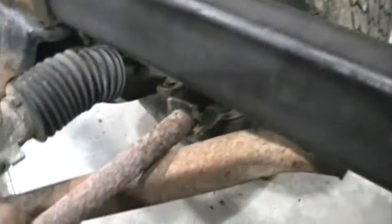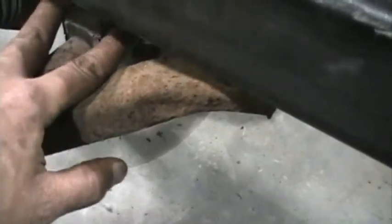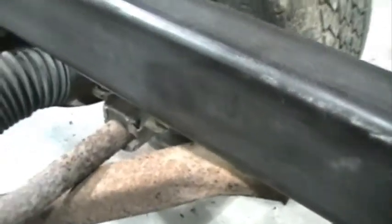Once that's set in place and marked and measured, we'll tack weld it into place and you'll see how nicely this lines up with the thing for the sway bar. I'm not going to need to worry about too much with it being a ute. For the other reinforcement member, what I'll do is tack weld bolts to the 3x2 there and bolt everything up from underneath. That way everything's removable, repairable, and not jerry-rigged. The same thing will follow through on the other side.